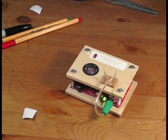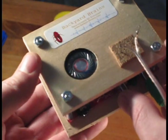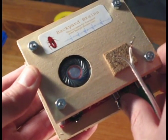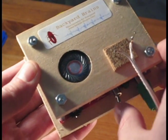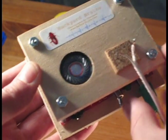Before we even hook up an invertebrate, we can test if the SpikerBox is working. With nothing attached to the SpikerBox, you should hear the speaker click on every time the power is cycled. If you hear something like that, then you're probably good to go.